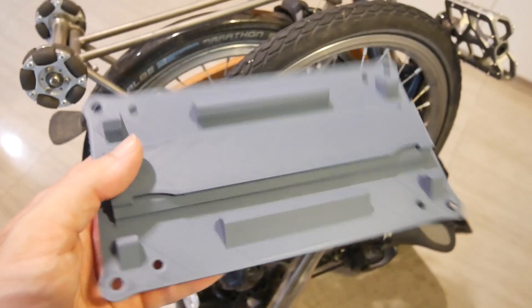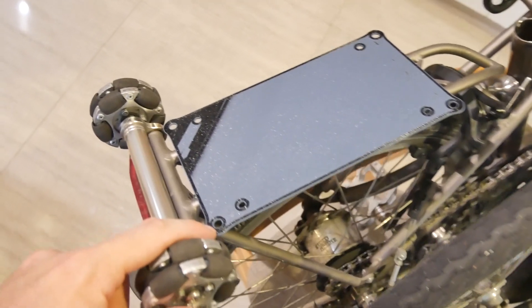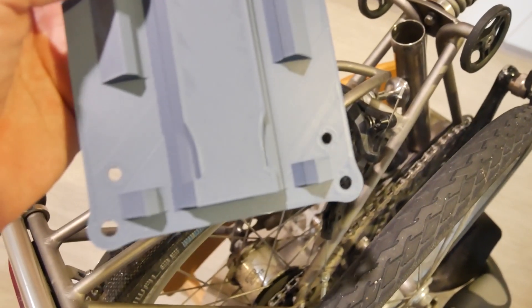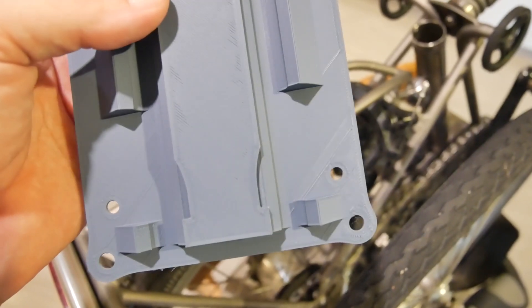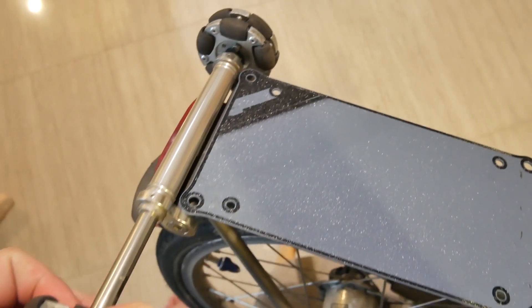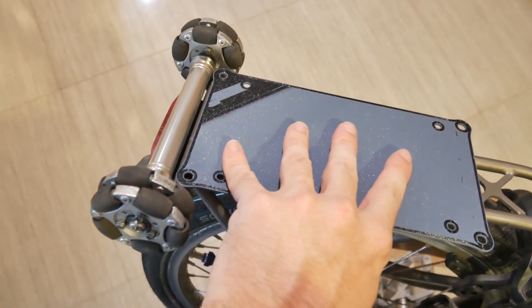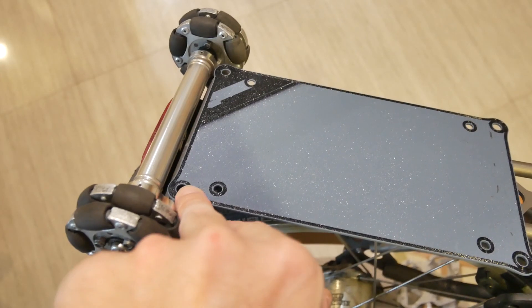This printed last night - it's a prototype of the basic attachment point I'm going to try to make work for the rack, and it almost fits, it's almost perfect. The only issue is we have these four holes on the far outside corners to attach to the screw points inside the bag, so their location isn't really adjustable. We're also constrained in the back by these wheels on the axle extender, and those attachment points are getting in the way of the mount points for the bag.